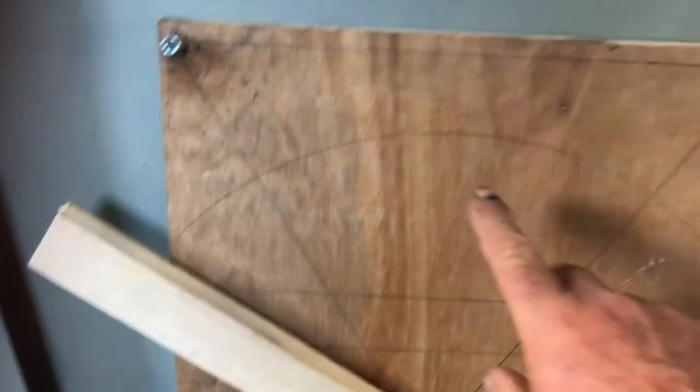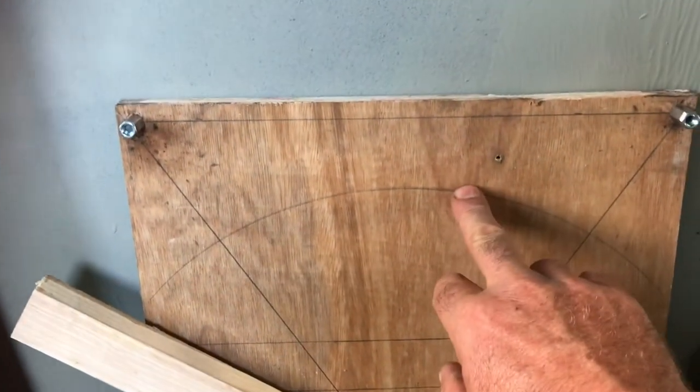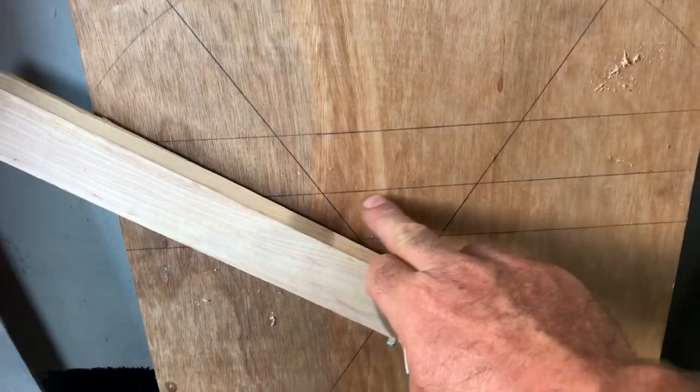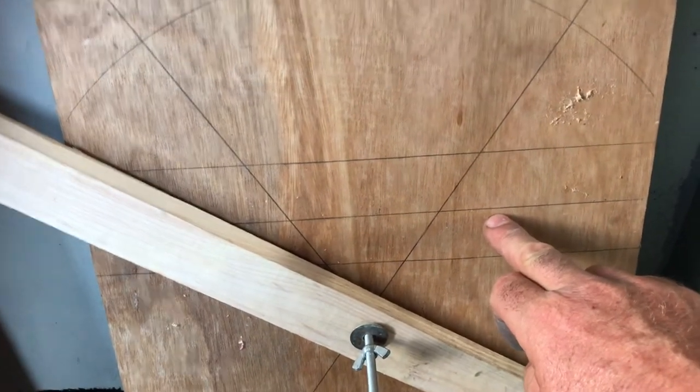Positioning the studs is easy. All I've done is copy the window image — there's the diameter of the window — and I've spaced the studs 10 millimetres bigger than the glass pack on the corners. Then I put a line through to use a spirit level and get it level. I offer that up to the window hole on the outside, make sure the circle is concentric with the window hole, mark it, clean it, spot weld it in place — job done.